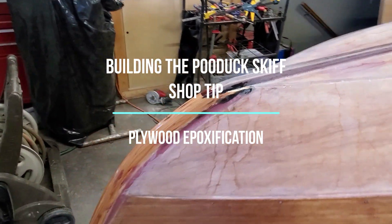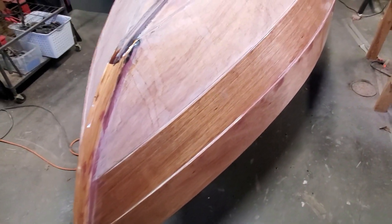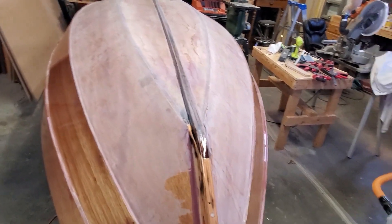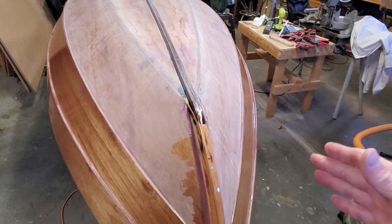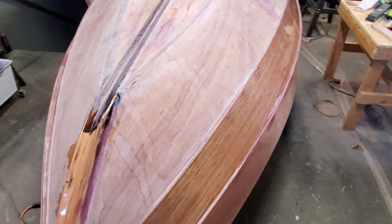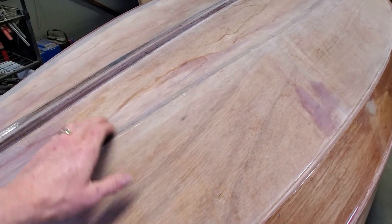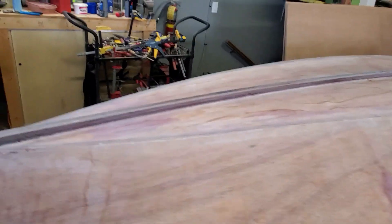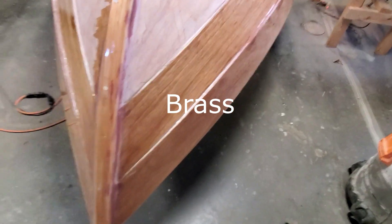Now I'm in the process of coating the exterior of the hull with epoxy. In order to give abrasion resistance and protect the plywood from water if the boat was sitting in the water for any long period of time, I fiberglass the actual bottom and the garboard strake with epoxy and six-ounce fiberglass cloth. I also included a four-inch run of fiberglass tape with epoxy before applying the cloth over the whole bottom — that was ground and faired, and then I covered it all with fiberglass cloth. There's also going to be a half-inch bronze rubbing strake screwed to the bottom and run up the outer stem.